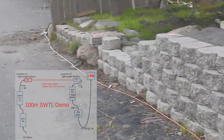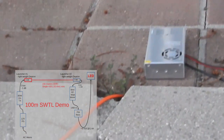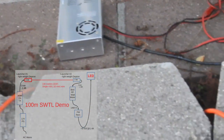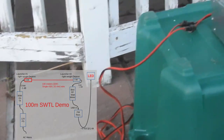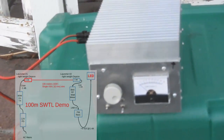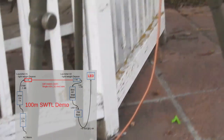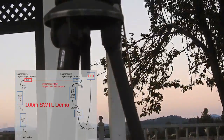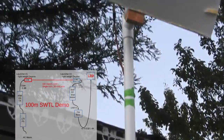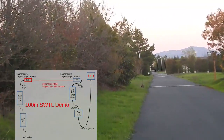The system is about the same. I have 110 mains coming in to a 12 volt 30 amp switch power supply that powers the exciter transmitter on 2 meters. That in turn goes through about 1 dB of cable loss to the first launcher, now a lightweight Depron foil launcher at the transmit end, along the full length of the 100 meters of line.